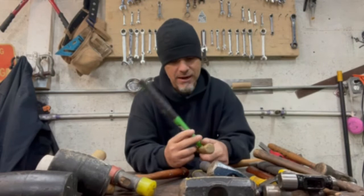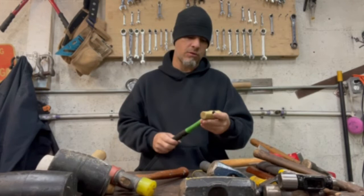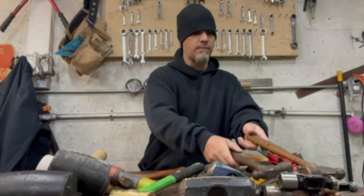Here I have a one-pound fiberglass brass hammer — this is for hitting metals that you don't want to mess up. Brass is so much softer than steel, so it can hit other metal and tap things in without damaging the metal surface. Because obviously if you damage a metal part, you've got to find a new one or fabricate your own. These are really handy for automotive and metalwork.